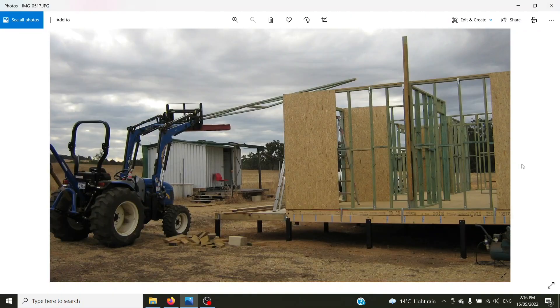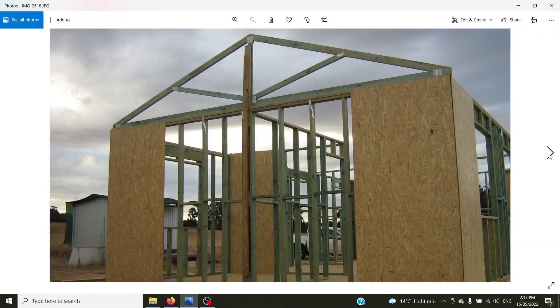Here's our first stage in putting the trusses up. You'll notice I've got a timber fastened to the end of the building at each end and the first truss will be stood up against that, so I popped it up on the forklift and got up on the ladder and slid it on. I've got a center frame here — that made it so much easier. If you don't have something like that you might have to put some sort of a support up there to carry it across if you're working on your own. That goes up, it's fastened in place, you put your anchors down, strap it down to the top plates and get it fairly secure.